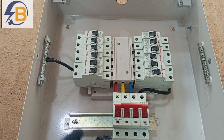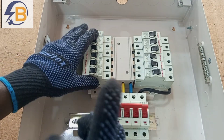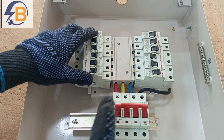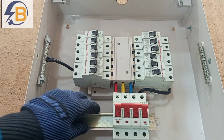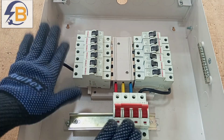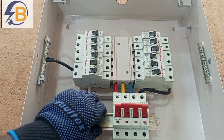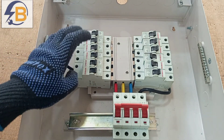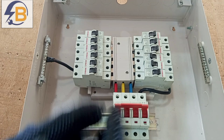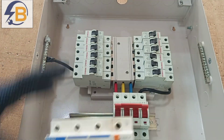When using RCDs in a three-phase wiring system, the best practice is to segregate the circuits and protect each group with one RCD. For economic reasons, if you can't do that, then at least there must be one RCD to protect the whole system. The disadvantage of using only one RCD is that when there is a fault — even in the lighting circuits — the whole system goes off, including all power circuits. Likewise, a fault in any power circuit will take out the lights too.